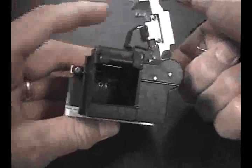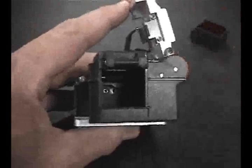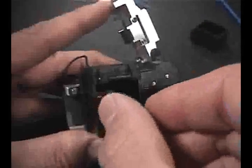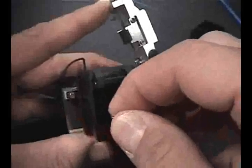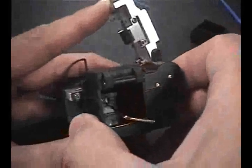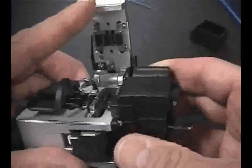Make note of the current blade number position. While holding the cover in place, loosen the set screw with the wrench by rotating counterclockwise one to five rotations. Use a cotton swab or similar tool to gently rotate the blade to the next incremental position counterclockwise. The blade should easily rotate if the set screw was loosened enough.